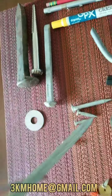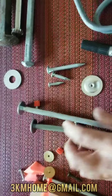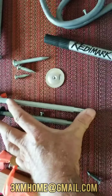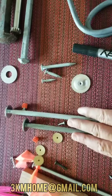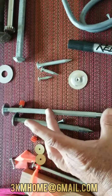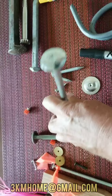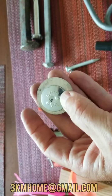There are also mag spikes, which have a big punch on top and come in different lengths. I still drill a pilot hole even in asphalt — just enough so the last few hits with the hammer wedge it in really well. I don't like when things bend. If I have any play, I might as well drill a pilot hole. In California, if you come across big mag spikes, they're probably going to be a monument. If the county calls for a spike and washer, your LS number and everything would be on there.